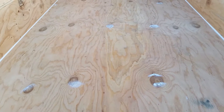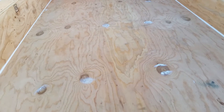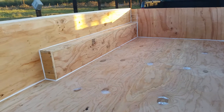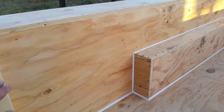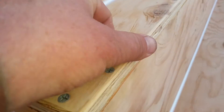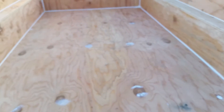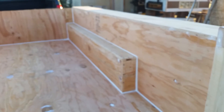You can save yourself quite a bit of money by buying the cheaper plywood and putting a little more labor into it. I just went over it with 100-grit on the variable-speed DA sander — the battery-operated one — and that worked great. It all comes down to the little things, like rolling an edge so it's not sharp. Rounding these corners makes a big difference. Right now it looks full of holes but when you put the paint on you're not going to notice it.